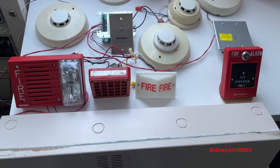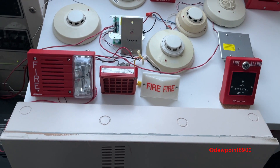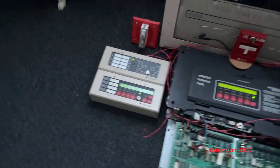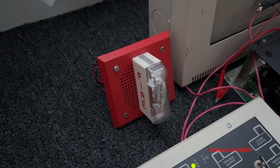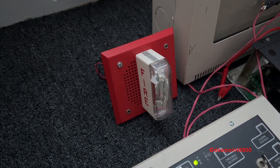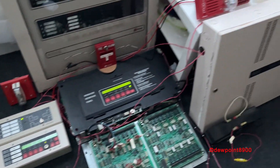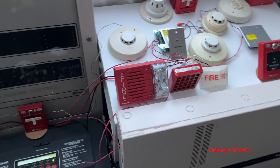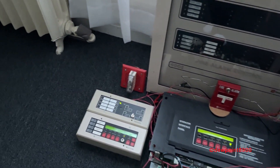Both the horn and the light only activate for a coded pull station, which has been disconnected for this demo. Down here we also have a Honeywell SC7156-1027 chime strobe, which is just a rebranded Wheelock CH70. The speaker will be playing slow whoop and the standard 4003 evac message, while the chime strobe will be set to code 3.